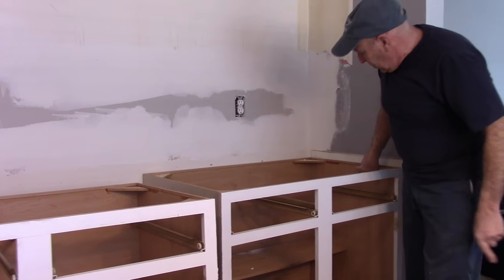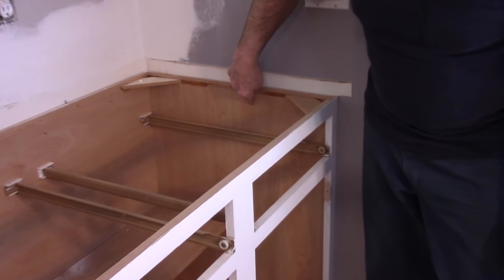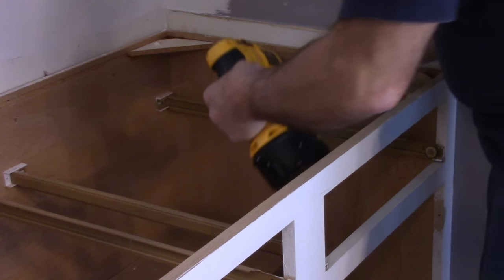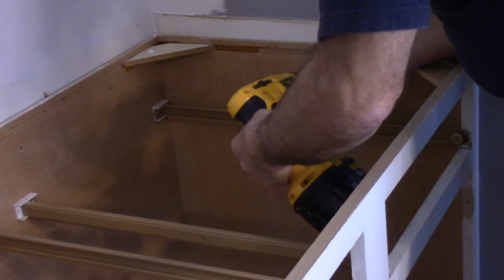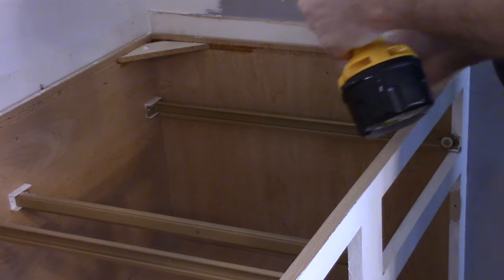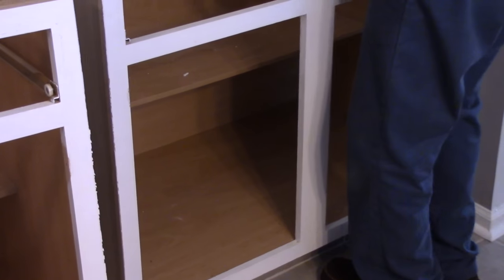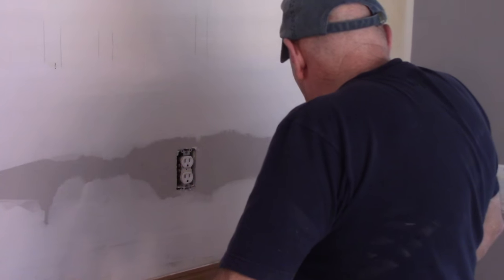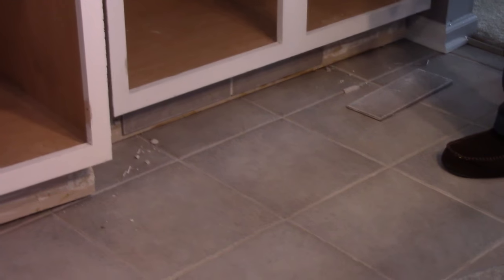And we're going to stop because I just noticed here, you see the screw in the side over here? It's actually screwed into a beam right over here. All right, so we're going to take that screw out as well. Okay, that should do it. We lift it. And the same thing, we needed to get this tile off on the bottom. But now all three cabinets are out.